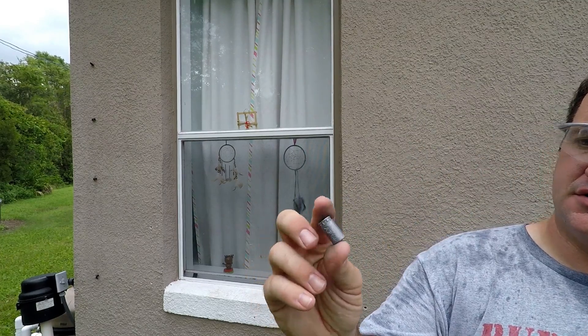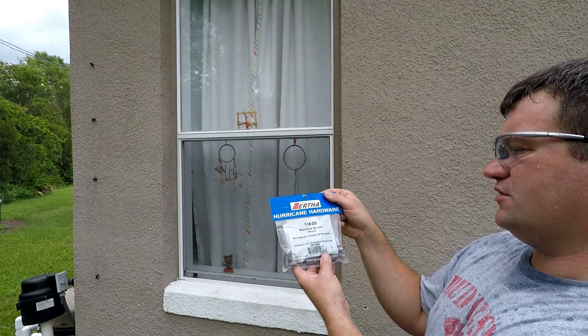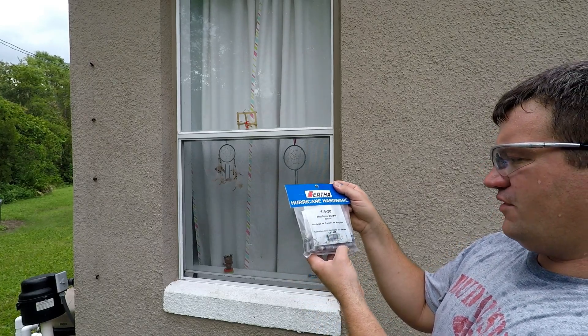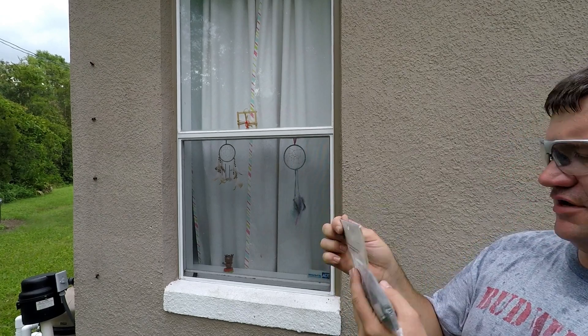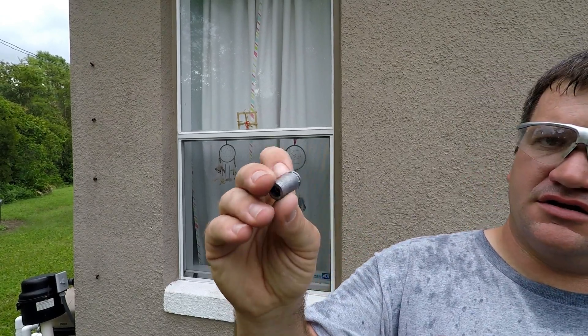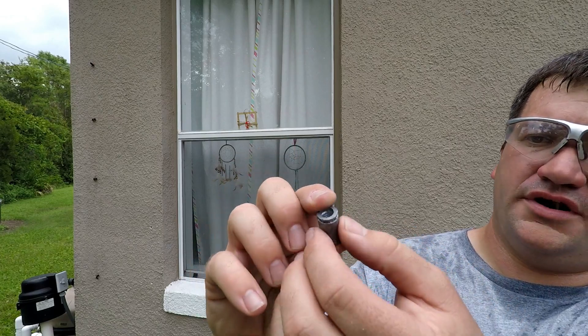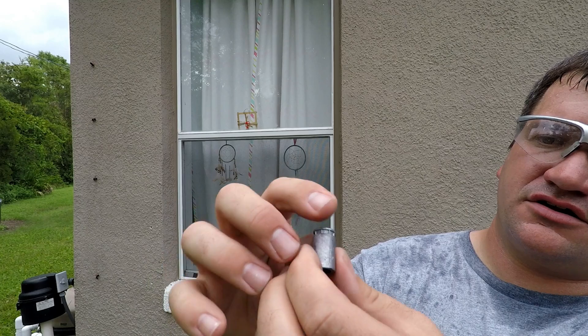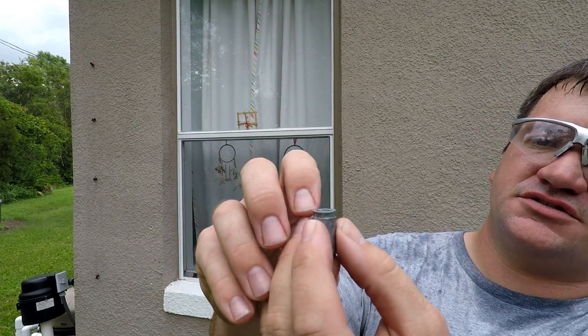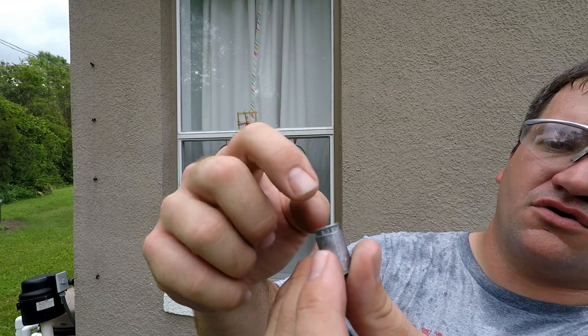You'll see there — it's a Bertha Hurricane Hardware Quarter 20 Machine Screw Anchor, item number 157-448. You can buy them at Lowe's, 8 to 10 bucks a bag. One end is kind of a wedge; it goes into a lead collar — it's lead, by the way folks. You'll see this end: that's the end that actually goes into the wall right there after you drill your hole.